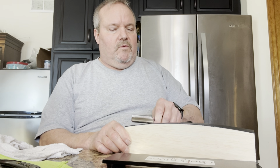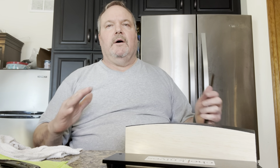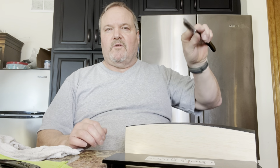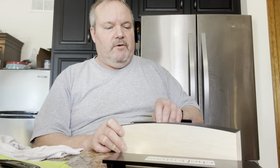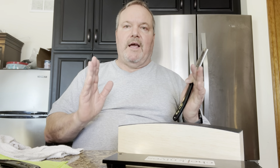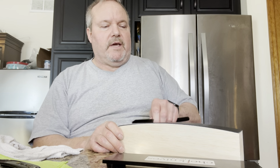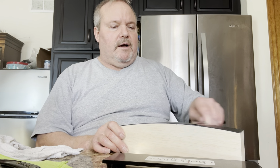The jury's still out for me whether this particular piece of material is what I'm after. But rather than having a hanging strop, where no matter what you do it's going to give, okay, and as you move your razor across this direction or whatever direction, you're going to bow that hanging strop in, and you're actually going to begin to have some effect where right here now I have a hollow bevel. You would actually begin to convex that edge itself, which is not really what I want to do. I want to have that bevel be hollow, okay. This does have some amount of give, plus it has the curvature, so I do believe it does get to the edge.